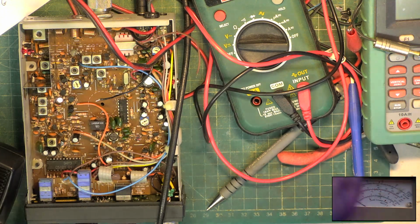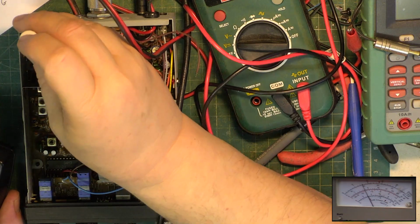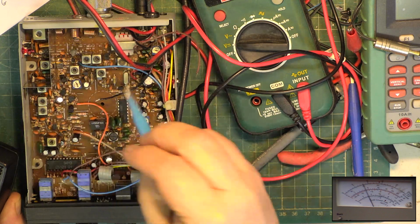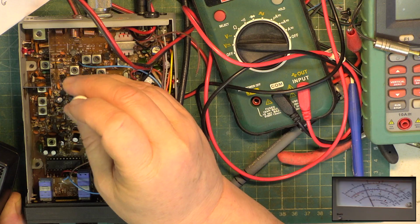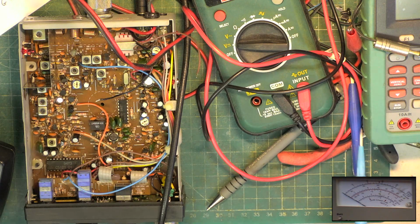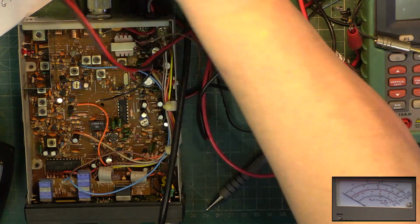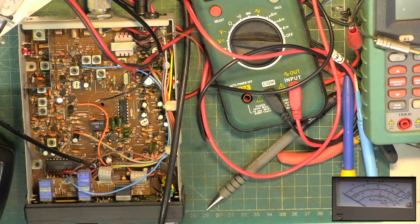I will just check it with the spectrum analyzer, which I'll put on. In fact, I'll tell you what we'll do. We'll put that to maximum, and then turn it down on the power preset. The legal limit of 4 watts. Now, last time we used the spectrum analyzer on a demonstration here, I was unable to get you to see. We've got lighting glare on the camera.